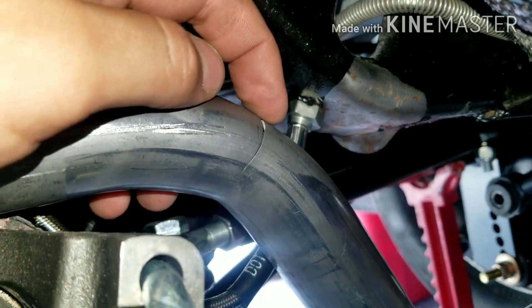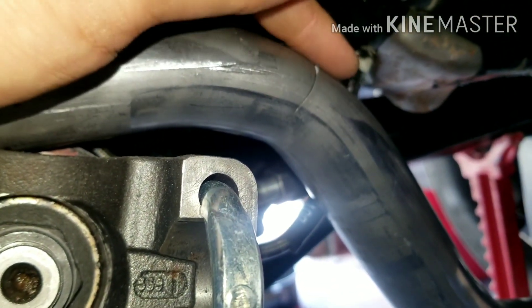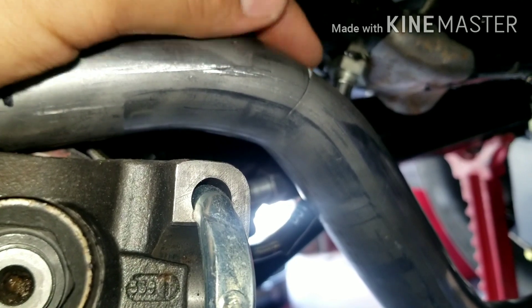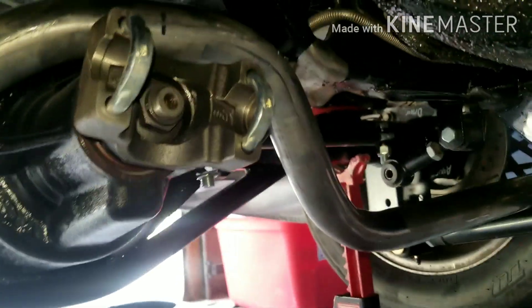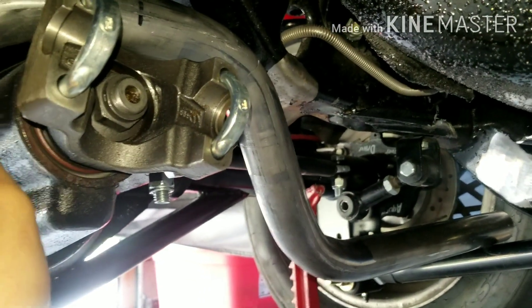I got to make another tube because we got a little ambitious and we split the tube. He even asked me if he should go a little further and I said give it one more bump, and that just immediately split the tube. We must have waited too long, because as it stretches it gets warm — so maybe we waited a little bit too long to stretch it one more time and it just got cold and split. This side worked out perfectly, and it's too bad because this tube actually fits exactly the way I want it to, except it's split up there, and it's not wise to weld that.